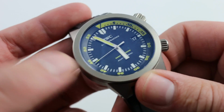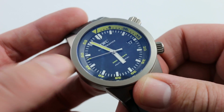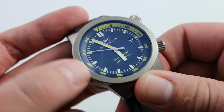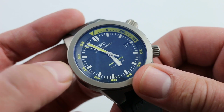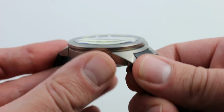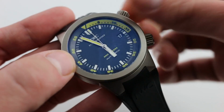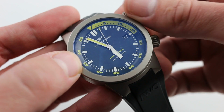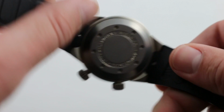Inside there is an IWC 30,000 series caliber. It is based on a chronometer grade ETA 2892A2. So the thinner and finer of the two principal ETA automatic calibers finds its home in here, modified by Schaffhausen, so you're not getting a stock ETA. Now, it features all of the underlying virtues of the 2892. Smooth bi-directional winding, a 42-hour power reserve.